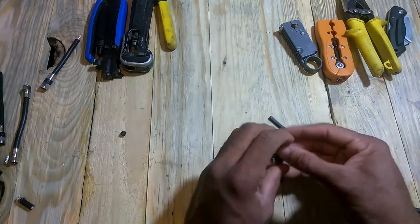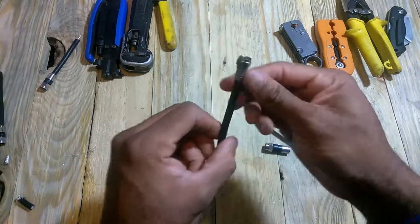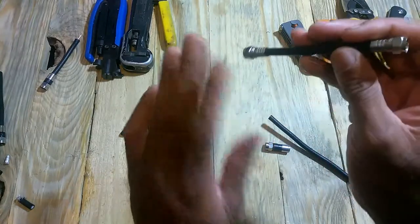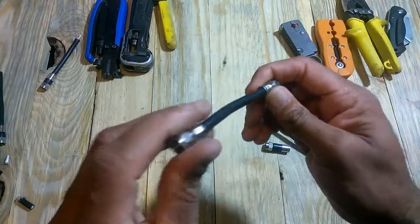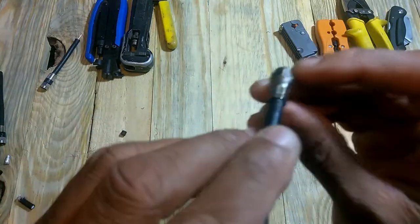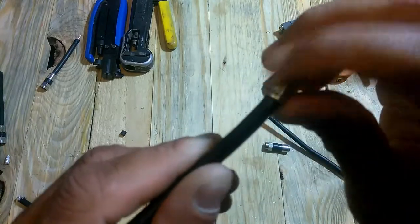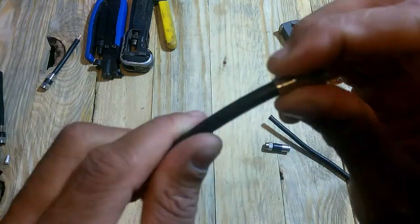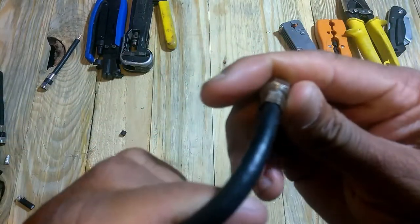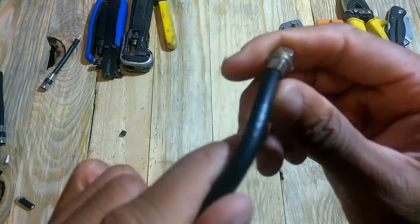You want to make sure you have a compression connector. You don't want to use the crimp style connectors, especially if you're using an outdoor antenna or if you're going to be using it in a place where there's going to be moisture. Because when you crimp a connector, you kind of mess up its outline — it was circular before. When you take a crimping tool, you kind of square it off or pinch that cable down and mess up the innards of it. And it's not really sealed from any outside moisture.